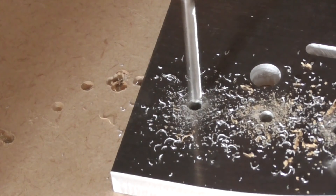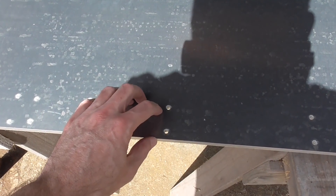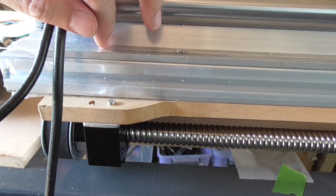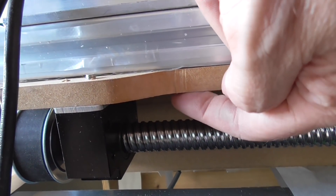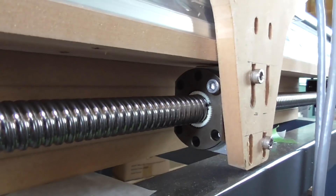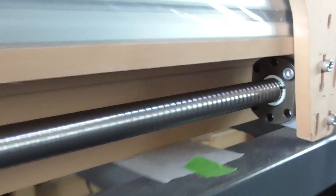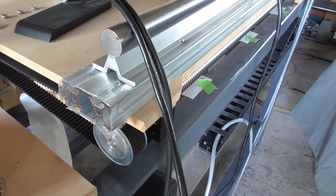What I should have done for these ones is make them five millimeters, then drill a little bit extra and tap them for a six millimeter tap. What I'm going to have to do now is deal with a bolt on the back where space is getting a bit tight. Over on the MDF mock-up, we're going to have a bolt going in from the top and then a nut, but when this bit slides along there's not really much space. I might have to counter-bore in the bottom and put the bolts through from the bottom. I probably should have just tried to tap those holes instead.